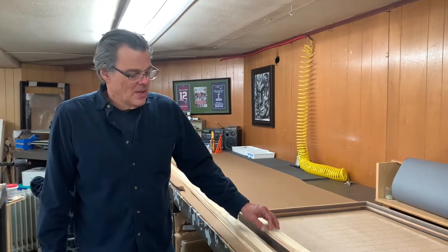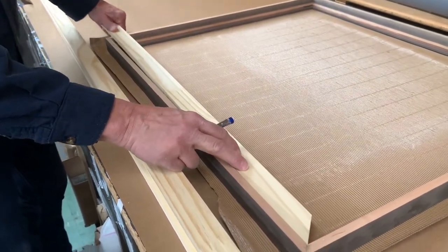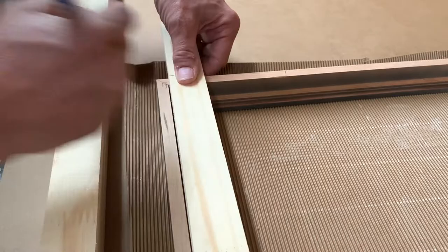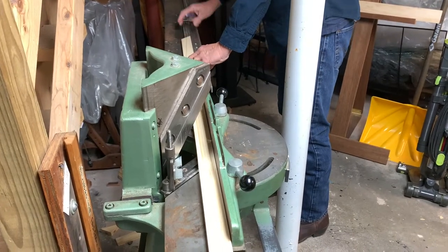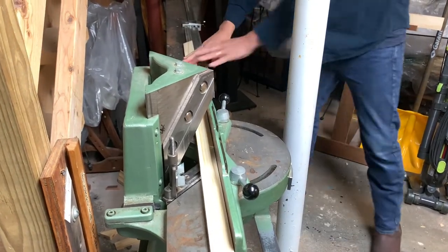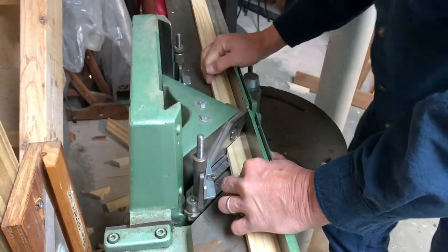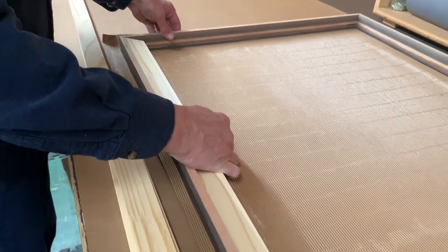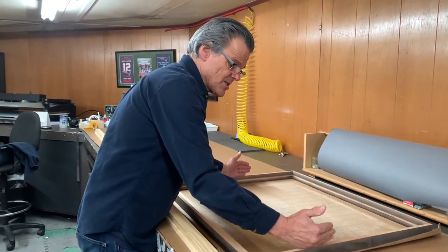Building a strainer back — here we go. Rather than measure this, I prefer to cut my first 45, put it right in the frame, and measure to the frame itself. I make a little mark here, then go over to my chopping machine and cut it. This fits perfectly — there should be a little bit of wiggle room and there is. We'll talk about that in a minute.